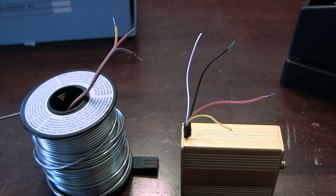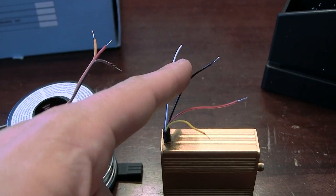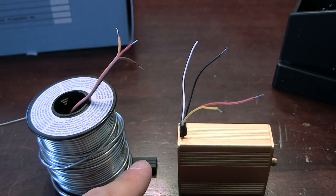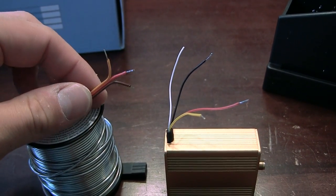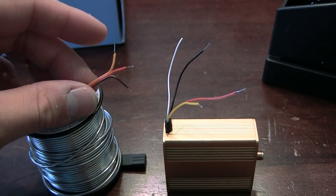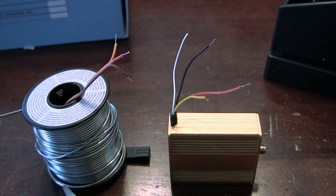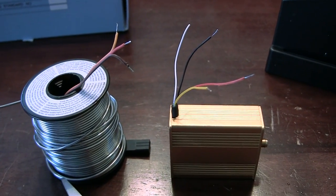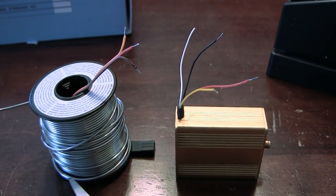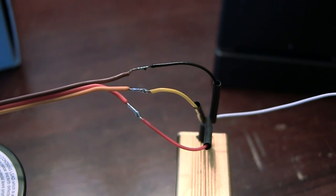Let me show you where we're at with the wiring. I've stripped the connector off — I'm not dealing with any audio, so I have ground, positive, and video. Everything's tinned on the other side. I have a servo lead female end and you're basically going to connect color to color: orange goes to yellow, red to red, and brown goes to black or ground. From there, solder everything up and you've got a nice connector. Let me finish the solder job and the video system will be ready to install. Wiring is finished, everything's connected up and about to slide on the heat shrink and seal everything up.